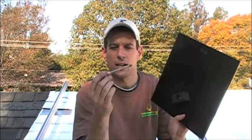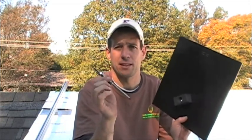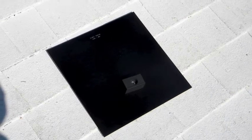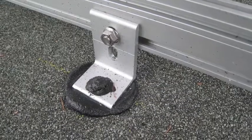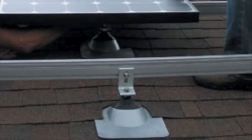One fantastic product we're going to install today is the PV Quick Mount. It's essentially these two parts: an aluminum flashing with an aluminum square, and a lag bolt with machine threads on the opposite side. It's quick, easy, and extremely effective. The quick mount tends to be more expensive than other methods; however, the cheaper methods run the risk of water leakage or are extremely labor intensive.